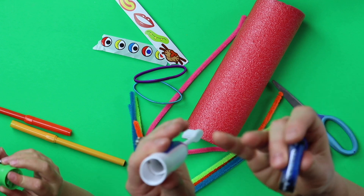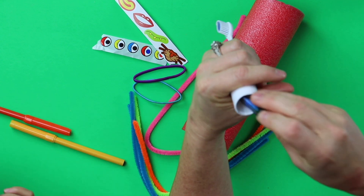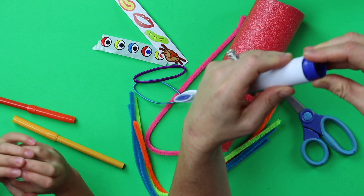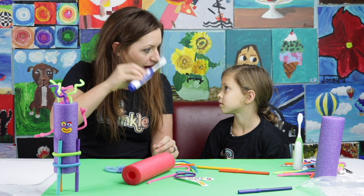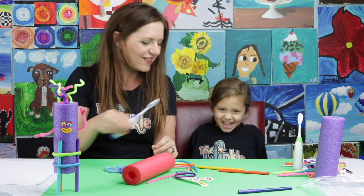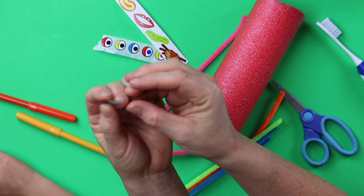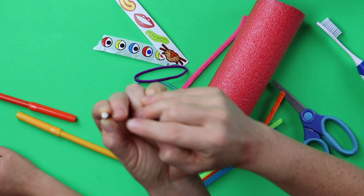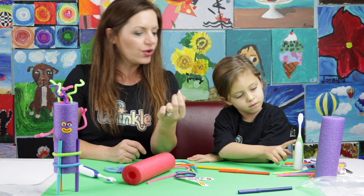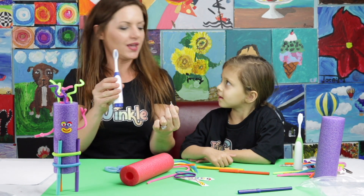Once those pieces are pulled in just a little bit more into the middle of your toothbrush, put that negative side into the middle of the toothbrush, match up the arrows, and test it. Inside of your toothbrush is a vibrating motor. Vibrating means when it goes up and down and wiggles and gives you that tickle brush feeling. The vibrating motor has this piece that spins around when it's attached to the battery, and that puts it off balance. When you're off balance, you're moving around — and that's what makes your toothbrush all wiggly.